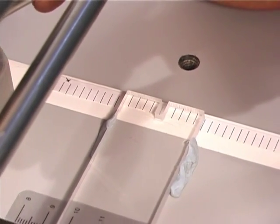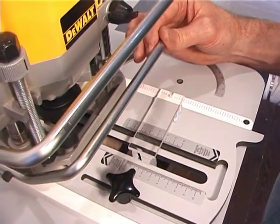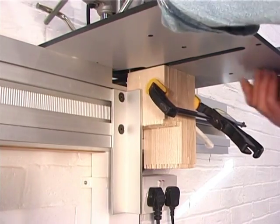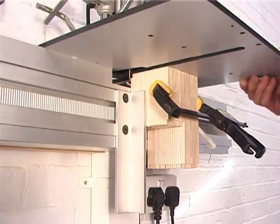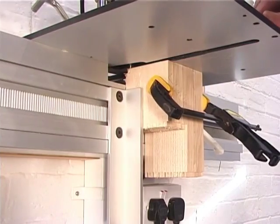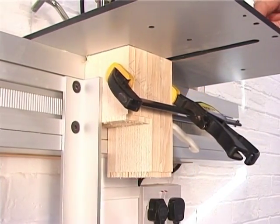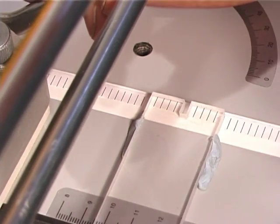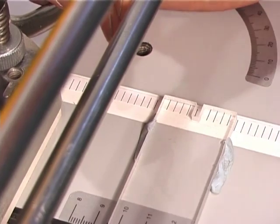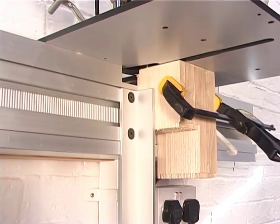Marking out is done on the first board or on the guide rails. A cursor on the router plate is set up against the picture of all the joints, and the cutter is fixed at each position. This 3mm interval can be laid out on a PC. The cursor can be a scratch on a piece of acrylic or an actual cut made with the bit you are using. Move the cutter forward and we get the next cut, and so on.